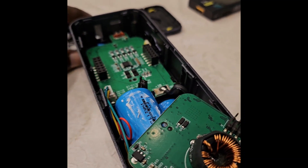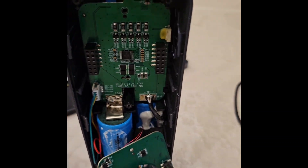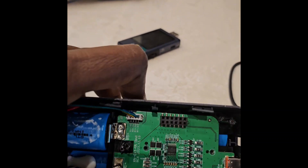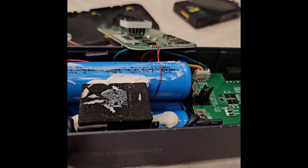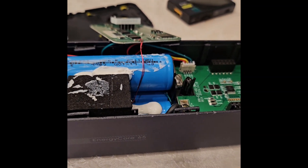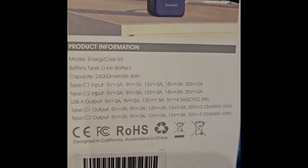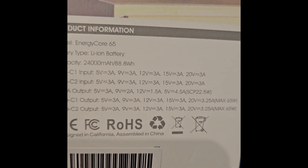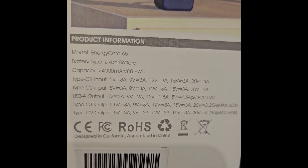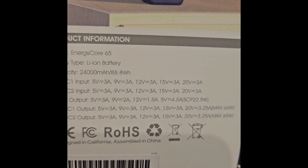In conclusion, I wouldn't call this extraordinary — it's pretty ordinary. The manufacturer tried to cheat: it says 24,000mAh but delivers only 20,000mAh. The rest of the specifications seem correct, but if someone asks whether I'd buy it again — I would not. The 60-watt input seems correct, and 65-watt output is pretty hard to achieve.